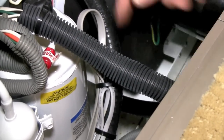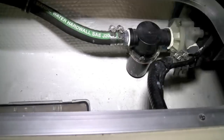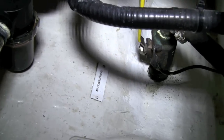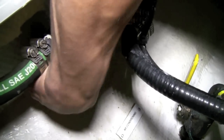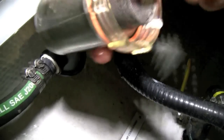Now I know where my pickup is — it's in the back over by my pickup for my shower stall and my sump pump. So we're going to come back over here. This is where it picks up from; you can see this is the valve over here. That closes it, that opens it — you want to always leave it open. That's the pickup and what it does is it comes through and brings it out to the air conditioning system. Here's your filter. I did loosen it up before and you just loosen it up like this. Drain out all that water and there's your filter.